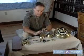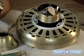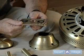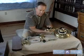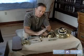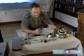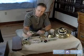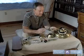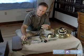We're going to go through what the components are. We've unpacked the box, spread them out, made sure we had everything. The main motor drive assembly, the hanging bracket that will go up on the ceiling attached to the box. This is a canopy that will go up and attach to here. We've got the extension. Depending on your installation, either we'll have no extension, the long one, or the short one, and we'll discuss planning that. Just to cover for the base here, we have the screws, we have the mounting brackets — four — that will go in here that the blades will attach to. Those are the components.